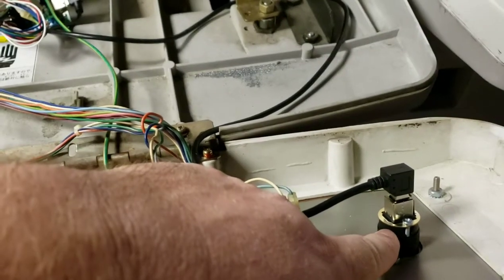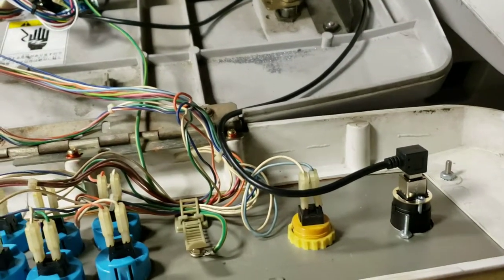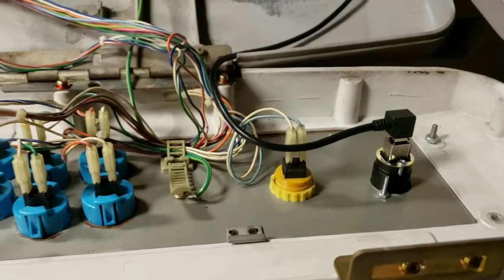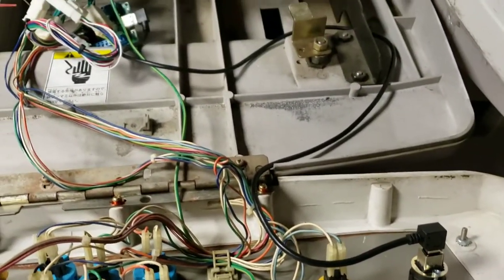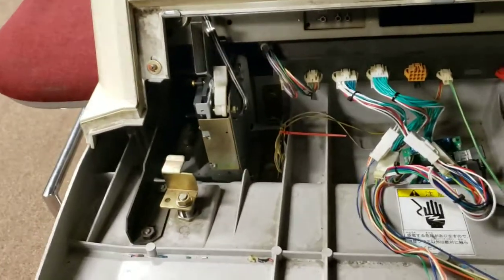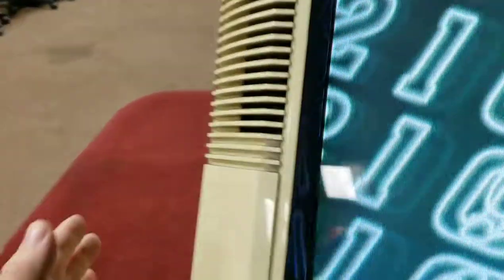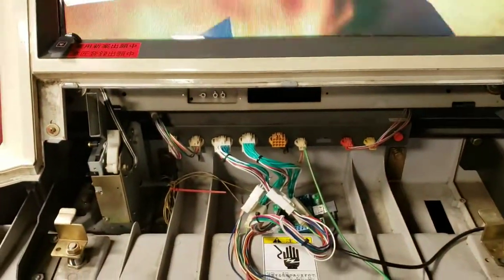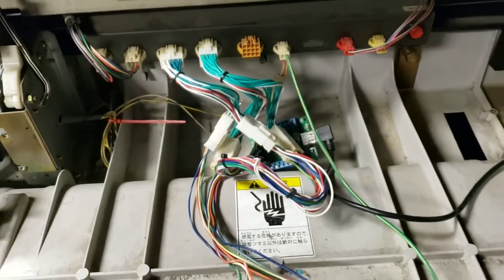Basically run it to your Neutrik adapter. If you want to know what these are, these are Neutrik adapters — you can buy them on Focus Attack, all of our local gaming shops, Paradise Arcade, and even Amazon — I can put a link in the description. If you don't want to modify your cabinet in any way, you can simply get a USB extension cable — preferably a flat-style cable — and just run it through one of the crevices of the cabinet and tape it right here on the side. That way you can easily put it back to stock, because all you have to do is unplug this stuff, put the original cables back in, and you're back to stock. There are no permanent mods.